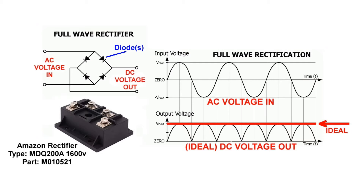The curves on the right show the input and output voltage. The top diagram shows the unmodified AC input voltage alternating from positive to negative. The bottom diagram shows that the negative voltage has been totally removed, which is the black wave. Note that while the current is now direct current, there is still some variation in it. To achieve the ideal welding effect, the DC current that is output should have no variation at all, just like the output from a battery. The red line, which is the ideal line, shows what the voltage would look like under ideal circumstances.